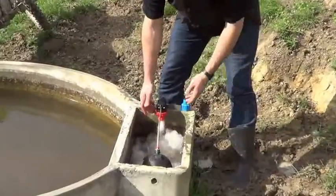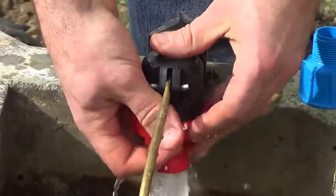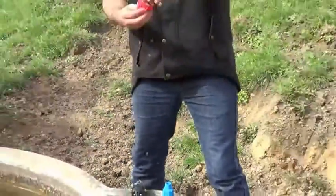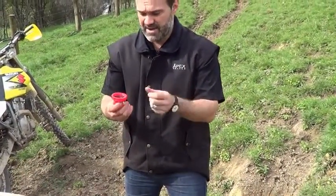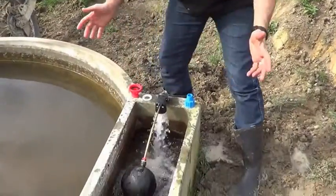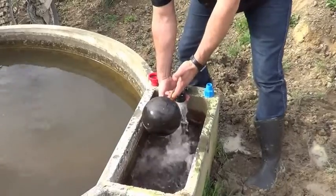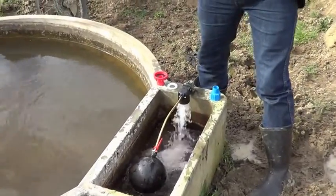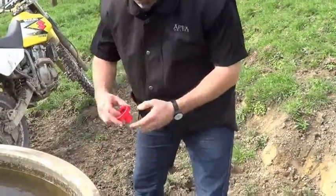Let's have a look at it in the trough. We can take it apart without using any pliers. So now I've taken the bottom of the valve out. That there is your flow enhancing ring, which needs to go back in the correct way up that it came out. And that's the washer that may need servicing on the valve. The second part of the service is to take the plunger out and check the o-ring. If you lift the arm up and put your finger in the middle of the plunger it simply slides out. So now you've got the valve taken to pieces and you can service the o-ring by replacing it, which is available in the XS service kit, and you can also replace the washer of the valve.